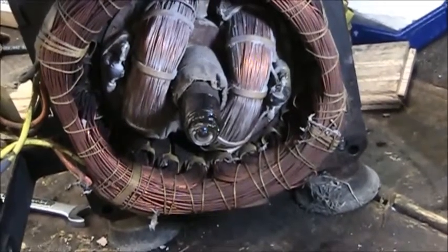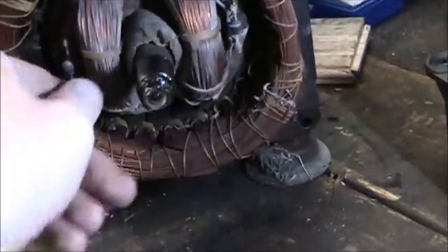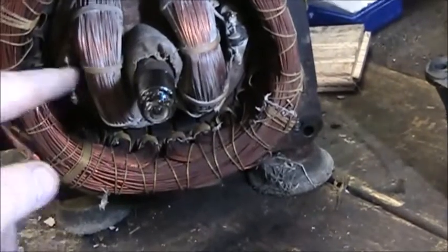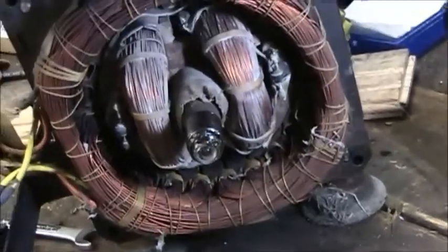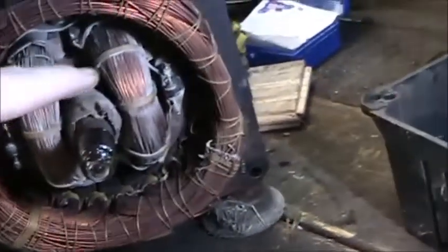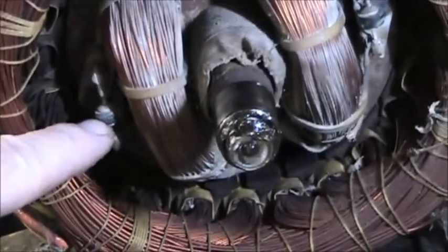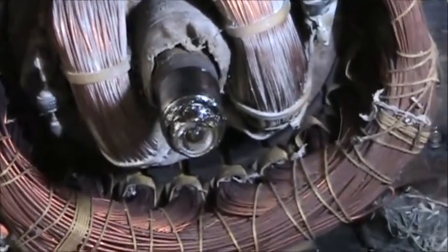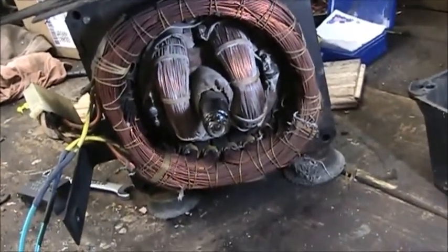I'm not really clear on how this works, but what I understand is: as these fields rotate, even though there's no electricity in them, there is a little voltage created which puts a field on these wires, which creates your electricity. There are two diodes you might want to check in-circuit — a diode there and a diode there. If they're not working, you won't get the right output.